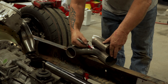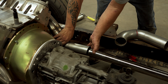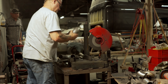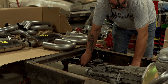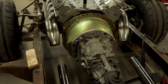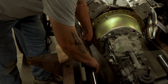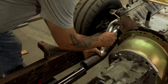We cut one of the U-bends from the Magnaflow kit at around the 30-degree mark. To keep things consistent, I put two pieces of the U-bends together and made a mark where I'd cut from the other side to match the first piece. Before making my cut to the other side, I double-checked the angle with one of the straight pieces of tubing on the driver's side. Looking good, I headed back to the chop saw and cut the U-bend tubing so both pieces matched up.